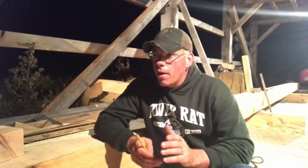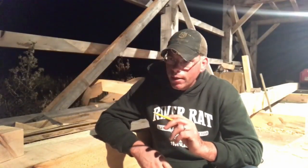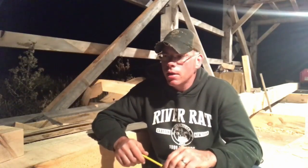We didn't get as far as we wanted to today with this. What happened was I got off on my cuts on one of these top plates. Not bad, nothing that wasn't correctable easy enough. I threw that one back on the sawmill and trimmed it down a little more. But the second top plate in, that's the one that I had trouble with, that I ran a blade that was too dull on the mill. And where I hit knots, the blade dived on me pretty good.